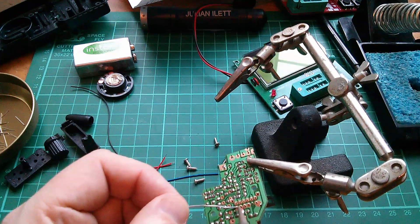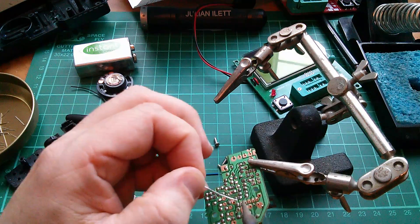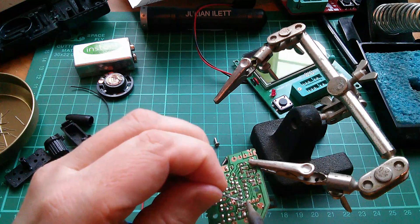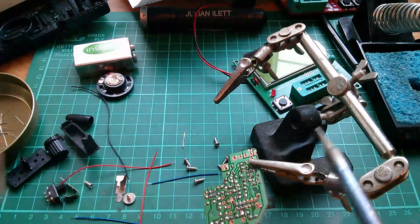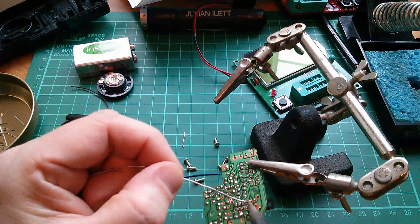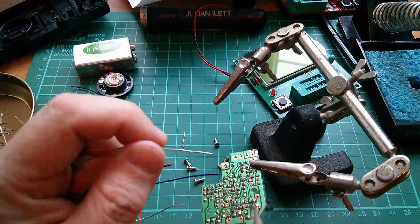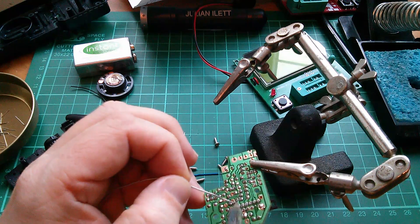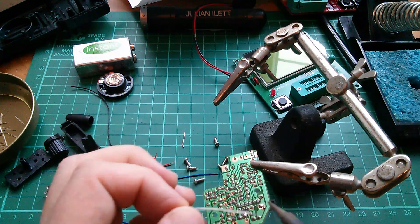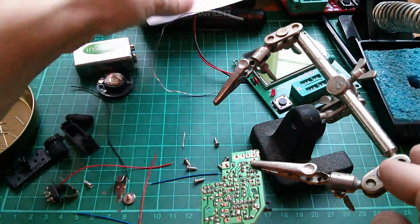There are some ground pins on this as well as the actual switch pins. This is quite fine pitch. My solder's getting a bit short - let me get more. The outer shell of this switch is also soldered. Not sure how critical that is, or whether it's just for mechanical mounting purposes - the switch is going to get a fair bit of pressure put on it when you're pressing it, so it probably is necessary to solder those. Okay, that's the switch in.